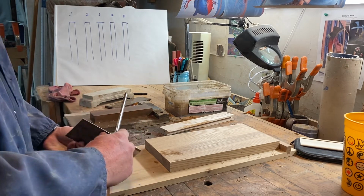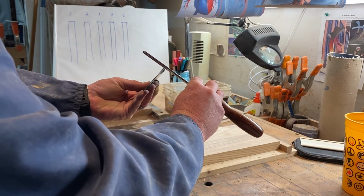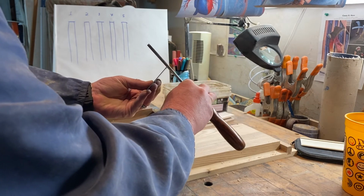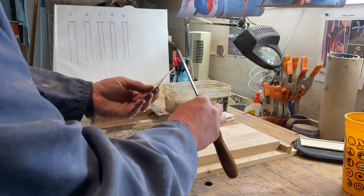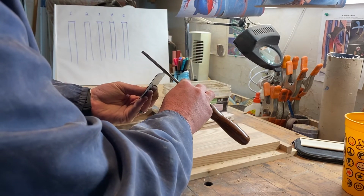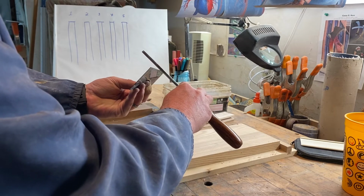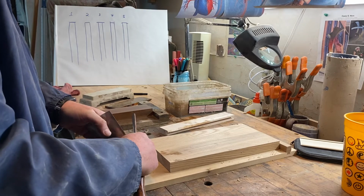All right, so the trickiest piece here is that I need to start with this burnisher at 90 degrees to this long axis here. I need to start with 90 and then just break 90. The rationale is that anything 5 degrees or greater is way too aggressive, and as I said, it's going to cut beautifully for the first pass, but then there's just not a lot of metal holding from that little horn to the scraper. So if it's really aggressive, that thing just shears off when you cut. So holding it at 90 and then just inside of that, 3 to 5 degrees is kind of great.